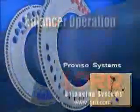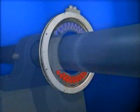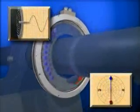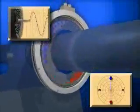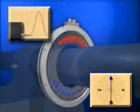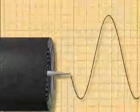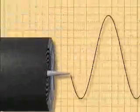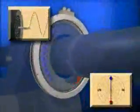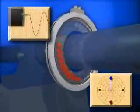The vibration sensor is mounted on or near the bearing center line and is continuously sampling the vibration level. This information is sent to a controller where the vibration signal is analyzed and compared to a user-programmable set of vibration trip points. When the vibration level exceeds the high trip point, an alarm is initiated. The controller then determines the amount of unbalance, the correction capacity required to make a balance correction, and the location that the counterweight rotors need to be moved to — often referred to as calculating the magnitude and phase angle of the balance correction.